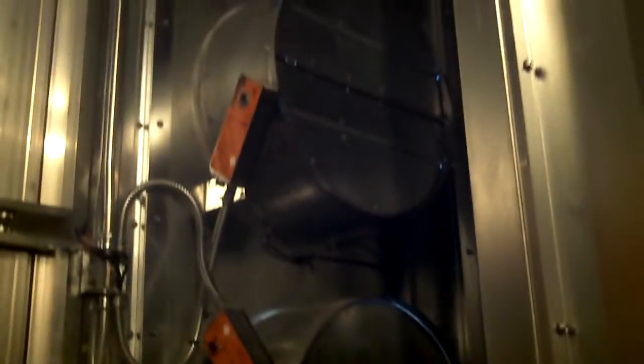Over here in the corner we've got a couple of track dampers. It measures the amount of outside air coming into the building and it's got air flow rings. If we want to go to maximum outside air, we open these other dampers here — that would be one hundred percent outside air. All these boxes are HEPA filters that haven't been installed yet. Over on this side we've got a mixer. It takes the cold outside air and mixes it with the warm return air to make sure there's no stratification.